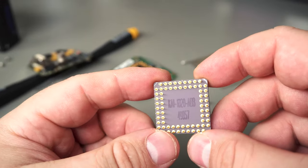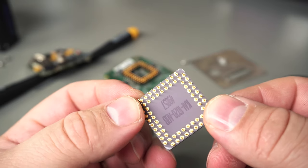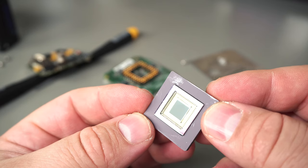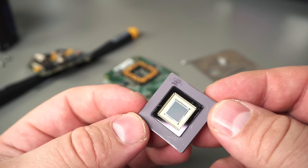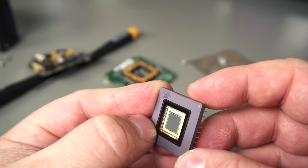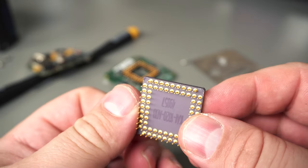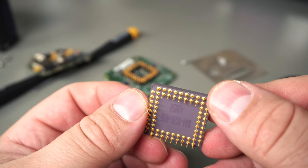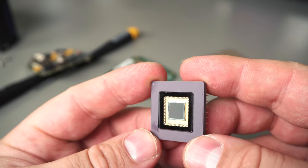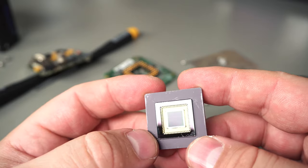I mostly got this thing for the lens. So this is the sensor — it's made by On Semiconductor, just in a nice little gold package. It's monochrome, a 1004 by 1004 pixel CCD, not a CMOS sensor. Hilariously, Mouser is selling this for $718. They've got a little piece of glass glued on it, so it has an infrared filter of some type. It has a wide operating temperature of minus 50 to plus 70 Celsius, and it can do up to 48 frames per second, which is pretty impressive. Though it does have advantages like a global shutter.